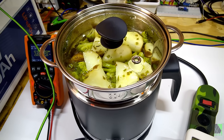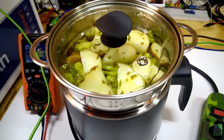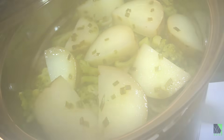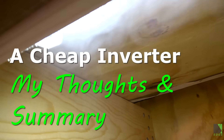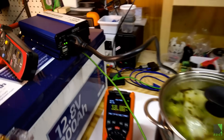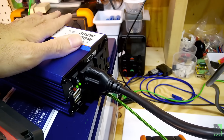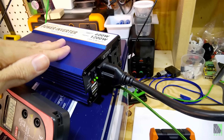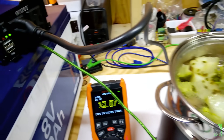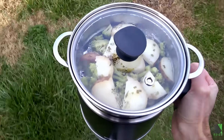I didn't time this but it's been running for quite a while — hopefully the food's not overcooked. So this inverter survived the test and is able to push 600 watts at its nameplate rating — pretty impressive. It gets a little bit warm, but nothing scary. I was even able to run my USB soldering iron using the USB-C port while it was cooking this food, pulling about 36 watts. So the USB ports are not useless.